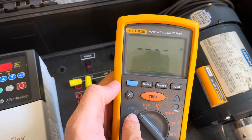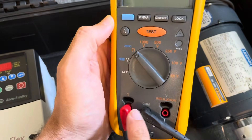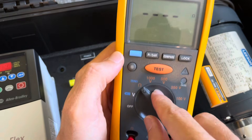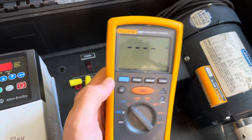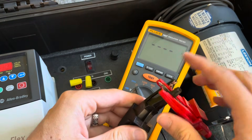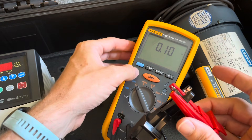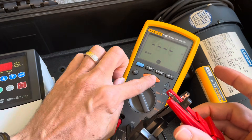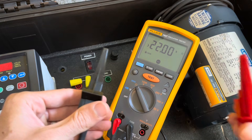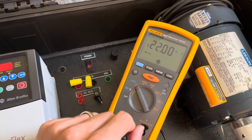This is going to be resistance. You'll notice with resistance, unlike most multimeters where the resistance is in the common, this one you do have to go over here — it's in orange. With resistance, you're not testing resistance if you just touch the leads together. I'll show you: put these together and I get nothing. I actually have to hit the test button to get a reading. If you wanted to leave it on, you can hit lock and then hit test, and you can do that in the insulation testing functions as well. Now it's a live reading.